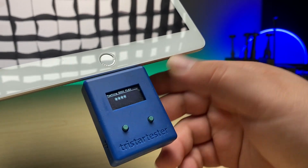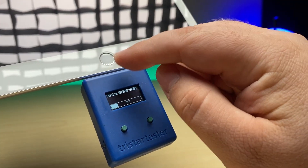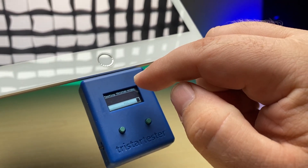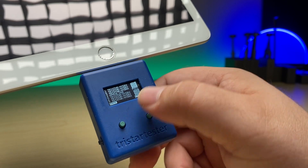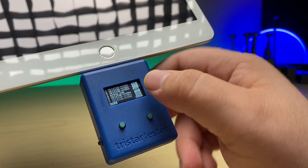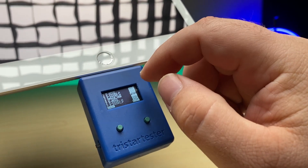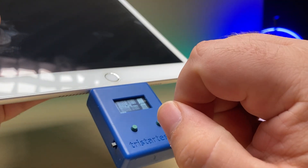Let's go ahead and run a quick test anyway. It tests the charge port as okay. Now it's running the test on the TriStar and we get fail. If we check more we can see that it fails on everything except for the main 5 volt rail, which means we've got a TriStar failure. Replacing that should be the solution.